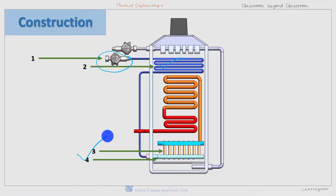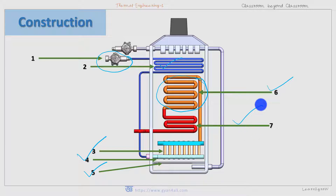The furnace is below or near the radiant evaporator, and below the furnace there is the grate on which the fuel is placed for burning. Next is the convective evaporator, and its position is above the superheater, unlike the Lamont boiler. The superheater in Benson boiler is situated near the furnace; therefore, the superheater tubes receive more heat and are exposed to more heat and temperature.